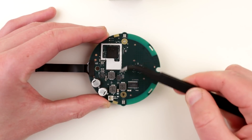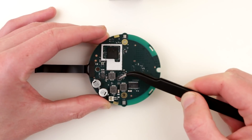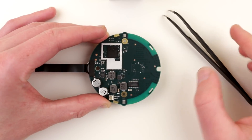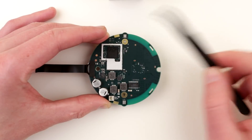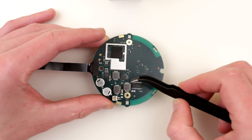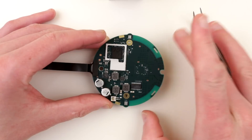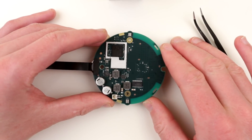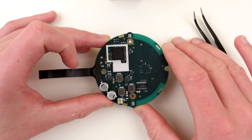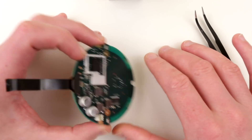It's physically processing a monophonic signal — there is no stereo anywhere. It has digital inputs, so the question is whether this processor actually processes stereo and this Texas Instruments amplifier just uses half of the data and drives the speaker, or if it all outputs mono. I think it outputs mono — why would you do extra work and use extra power? But I don't have enough tools to figure out what's getting into this amplifier. Maybe in the future with some sort of digital analyzer I would, but right now with my analog scope I won't see much, especially in the digital domain.